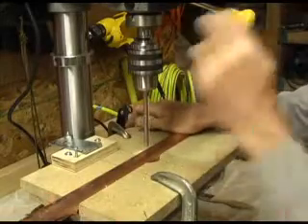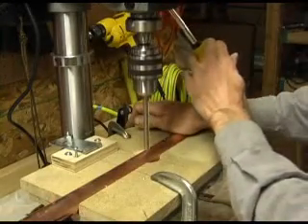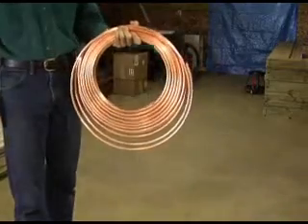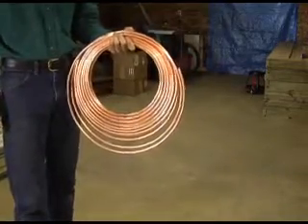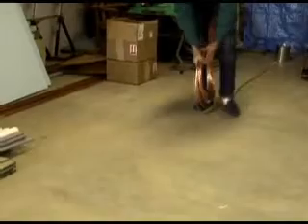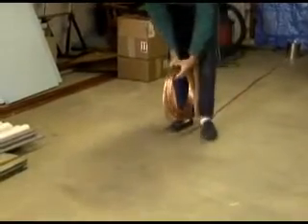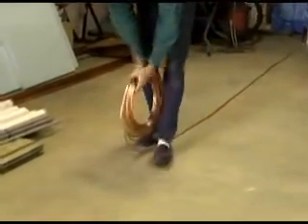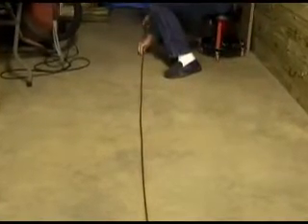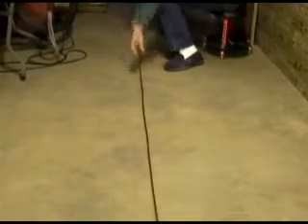My small copper tube has a 3/8-inch outside diameter. The smaller copper tube is 1/4-inch inside diameter. It is carefully unrolled on the floor to prevent kinks. I use 60-foot rolls because it divides perfectly by 90 inches. The larger diameter tool allows the smaller copper tube to be marked and cut at exactly 90-inch pieces.